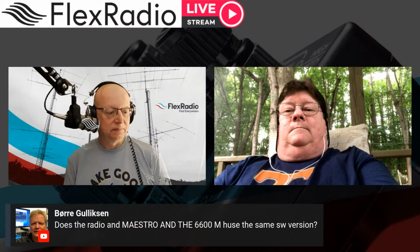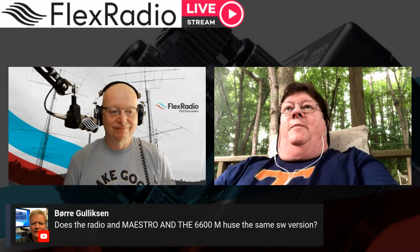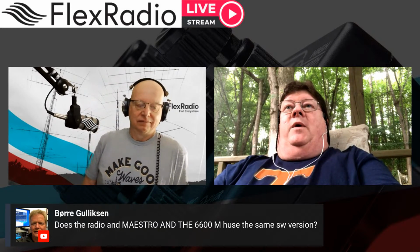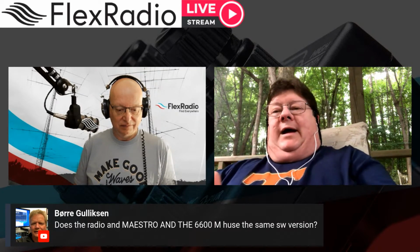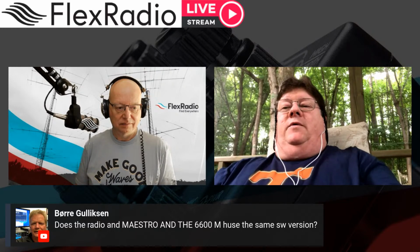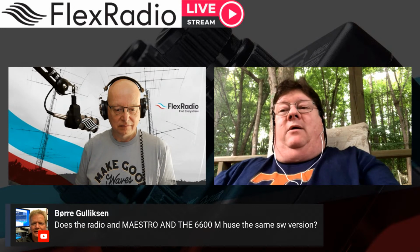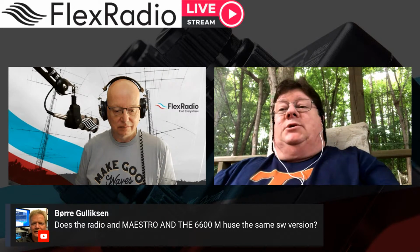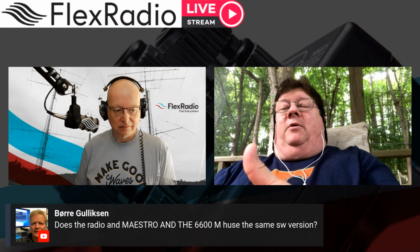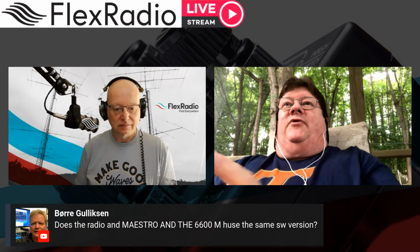This is a good question for new users, and this is something they had in place right from day one. Yes, they do. The software is a little bit different. Well, the software has a couple of layers, and one of the layers is what we call the HAL, or the hardware abstraction layer. The Maestro hardware is slightly different than the M model front panel hardware, so the low level of the hardware abstraction stuff is different between the two, but the upper layer stuff, the software that runs on the devices, is essentially the same, with some small caveats.